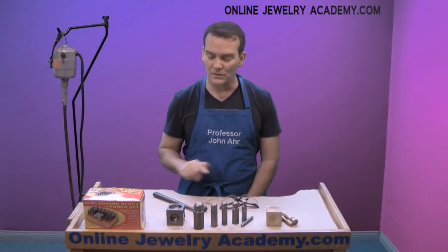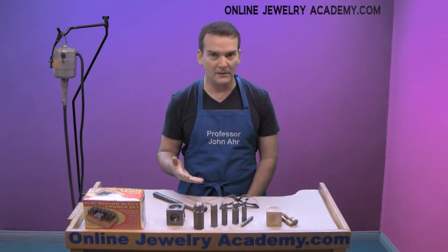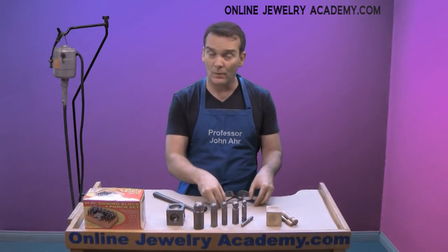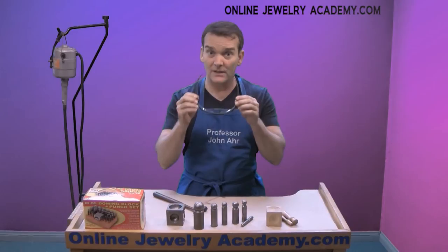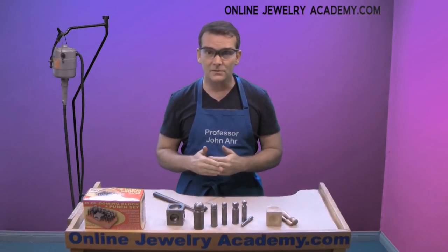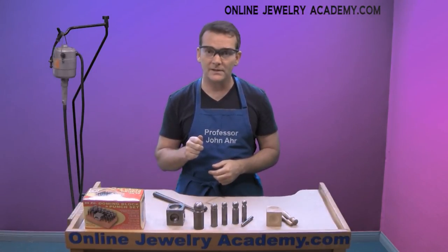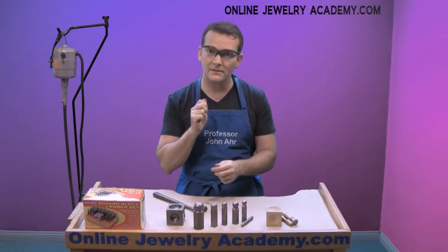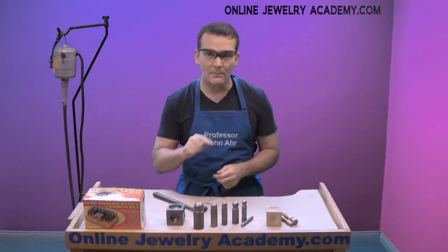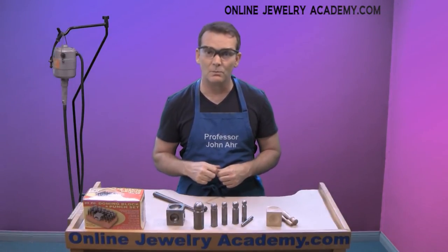To use this tool, you're going to need some kind of work hammer. You could use a brass mallet or you can use a steel hammer — either one's fine. But no matter what you choose to use, you're going to need to have some safety glasses. Safety glasses are important because anytime you strike a tool with a hammer, there's always the possibility that something could chip off the end of the tool and fly into your eye. If you haven't seen our safety video, now might be a good time to stop this video and check that out before moving on.